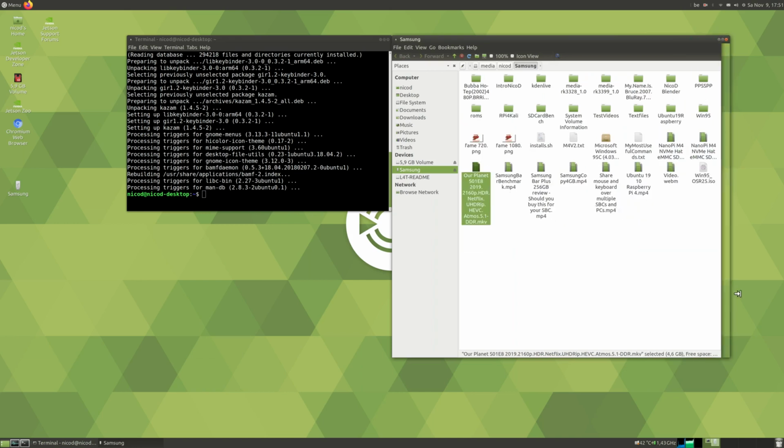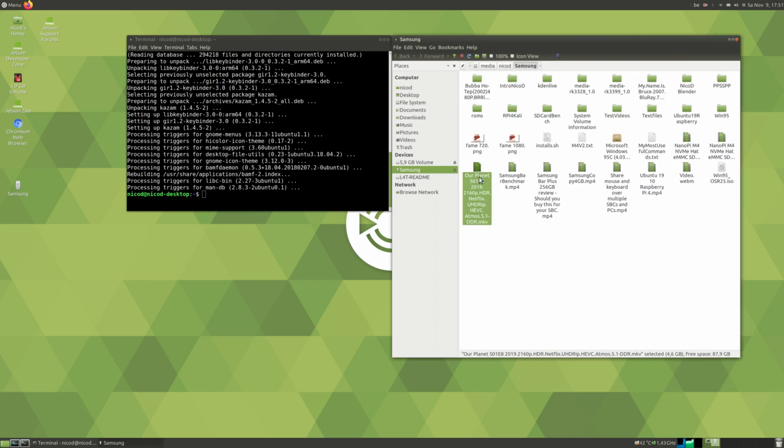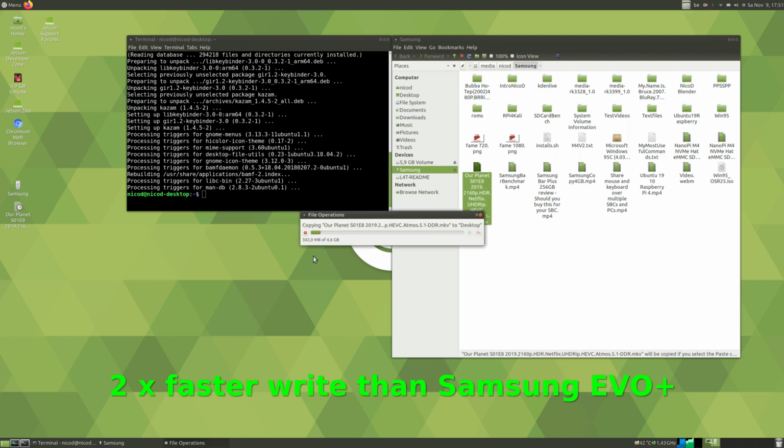I can already tell you something about the NVIDIA Jetson Nano. The read-write speeds of the SD card of that is the best of all my SBCs. With that it can do 80 megabytes per second reads and 80 megabytes per second writes with this SD card. I also tested different file systems on the same SD cards: exFAT, FAT32, NTFS and ext4. Only FAT32 performs worse than all the others. So formatting in FAT32 isn't the best if you need high speeds.